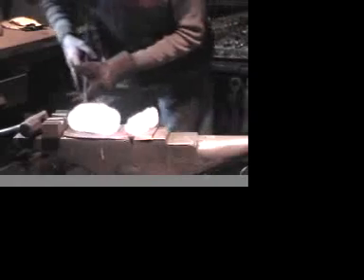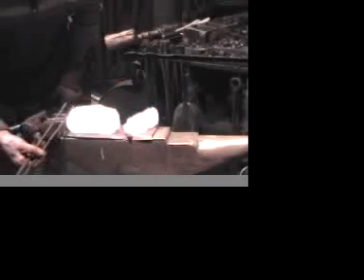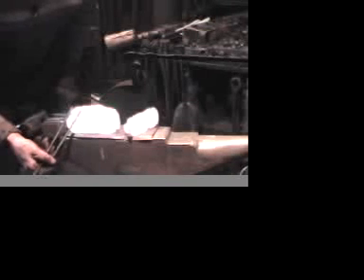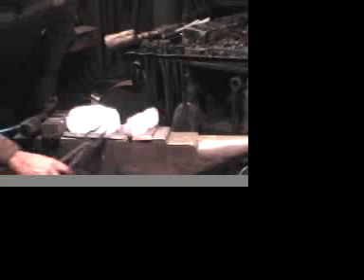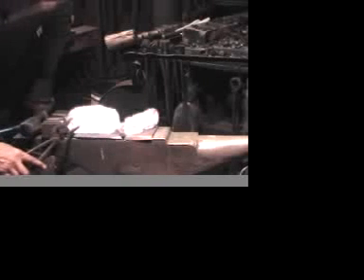You can see that I've severed off approximately a one-third chunk of the total bloom. If you look at this sideways, this will give you an idea about the depth of the cut. Yesterday I sliced from here down to that level, and I only had that last — at best half an inch, a third of an inch — to go for that final cut. As the material starts to cool, you can see that it's somewhat inconsistent within itself.